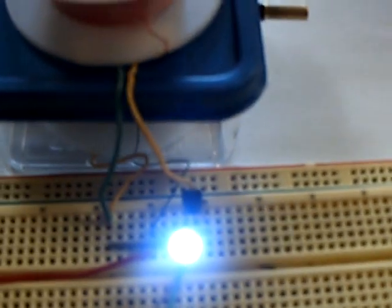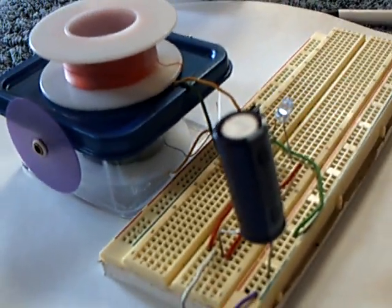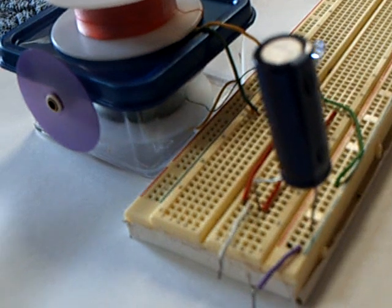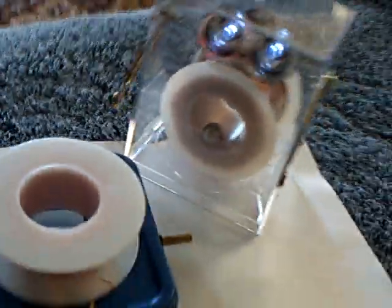It's also obviously not on a toroid transformer, but a very interesting little project. It all spun off of the hall effect circuit and made this little capacitor motor, which is pretty neat. It draws about 15 milliamps — not a real efficient thing because I've got poor bearings; it's just a bronze shaft running on a plastic box. Nothing fancy, but it works — and we ran Maggie. A lot of fun.